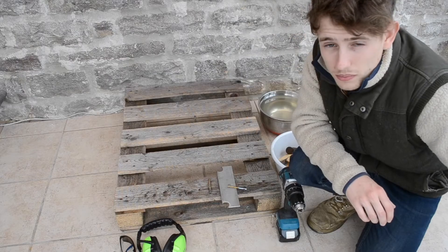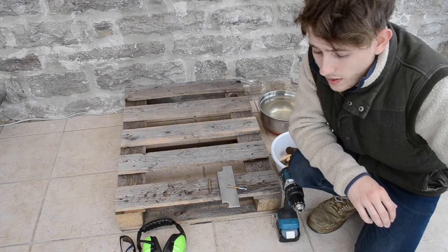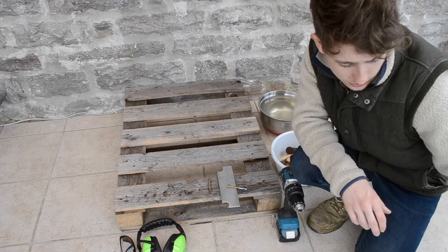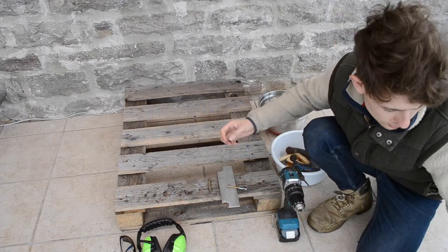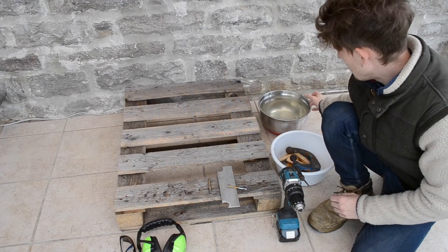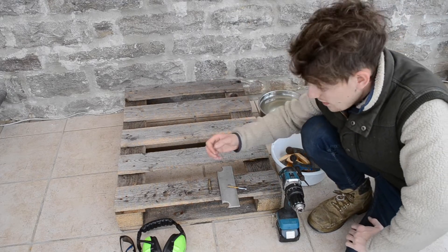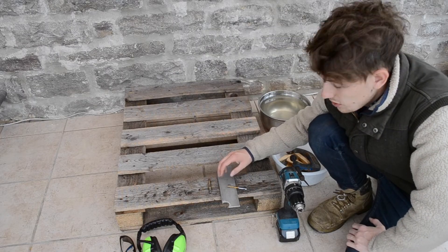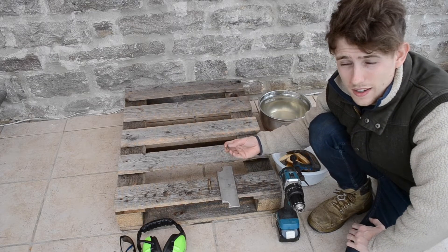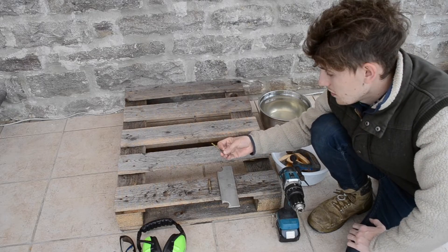Now the most important part about drilling anything is to keep the drill bit as cool as possible. There are two ways you can do that: you can use a lubricant like WD-40, or the better way I think, which is using a coolant. For that I'm just going to be using some water, and that's just going to keep the flat bar nice and cool, which in return will keep the drill bits cool, keep them from getting blunt, and also let them perform the job they're supposed to do.